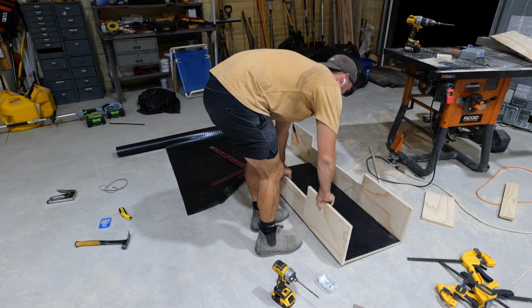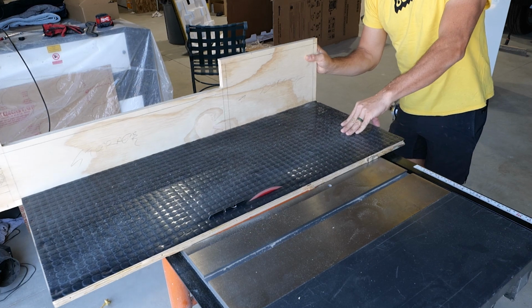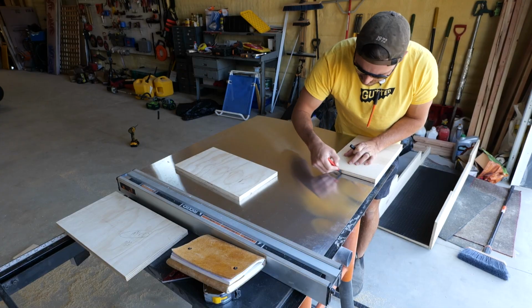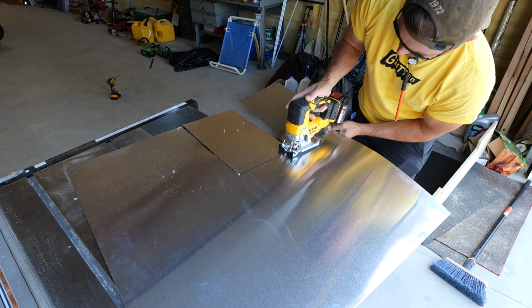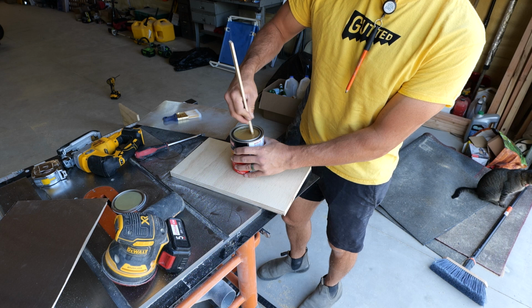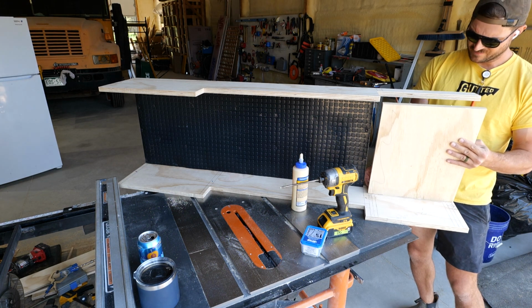The main drawer assembly is looking pretty good, although I did realize the next morning that I screwed up. I forgot to account for the 1.5 inches from both sides of the 3/4 walls. Luckily, it's an easy fix for a table saw. Now that our drawer is the right size, we're gonna cover most of the pine plywood that'll make up this drawer in aluminum. Like almost everything else in this build, I found these cheap aluminum sheets at Home Depot. We're using contact cement to glue them together, and we'll be installing it pretty much anywhere that might get hot or wet. While it tacks up, we'll start assembling the kitchen drawers.